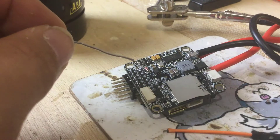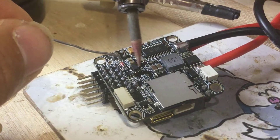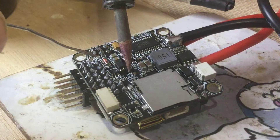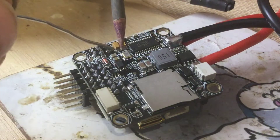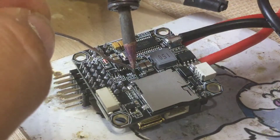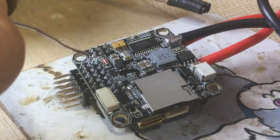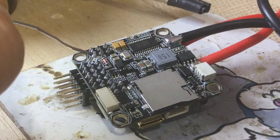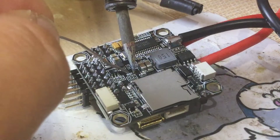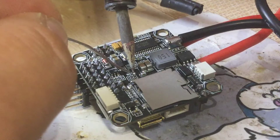What I want to do is get this cable the right way around. You'll see I'm coming in at an angle so I'm not going to touch any of the other surface mount components, especially considering there are some tiny little resistors down there. I'm going to give it a tiny little dab on the end. This is why I've suggested the V1 boards — because that's a straightforward pin on the V1 board, whereas on the V2 board it's an absolute toad.